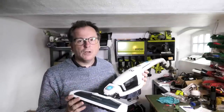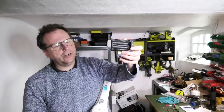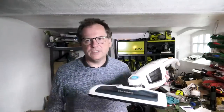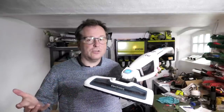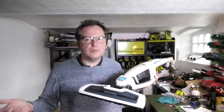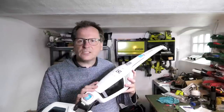I hope some of you will be able to fix your Electrolux vacuum cleaner. I mentioned this cheap 18650 charger — you can still use it, but you need to measure the voltage. I had hoped you could just charge all the batteries fully and they'd be balanced, but that's not the case because then they're over-voltage and the system won't run. It's also quite weird that it only handles about four volts per cell — I would have expected 4.15 or closer to 4.2 volts, because that's the maximum charge and you'd want to use all the power to maximize runtime.